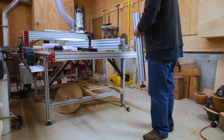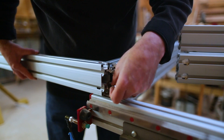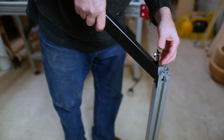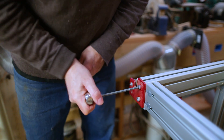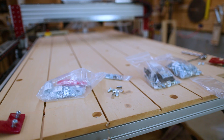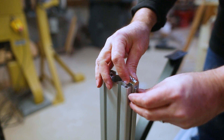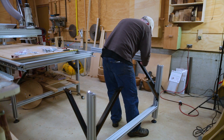There's a little metal plate that goes on the bottom of the leg piece and the foot can then thread into that metal plate, which makes the foot adjustable. Then there's a cross member between the two legs that goes on pretty easily. These are the two new legs for the extension and I can add the bracing while the end is still open and slide the nuts into the track. The stops have to come off of the existing frame but they're just screwed in place. Then the new extension will be spliced into the existing 8020 frame using pieces that fit into the slots on both and hold the two pieces together.